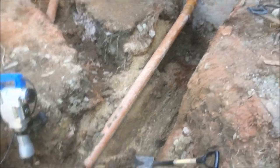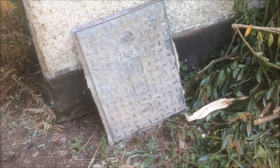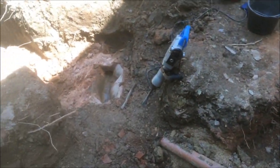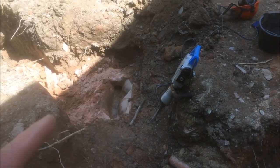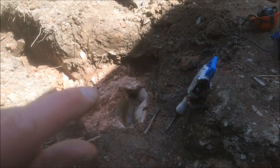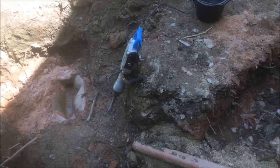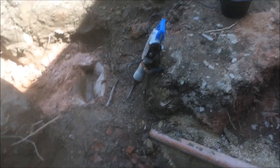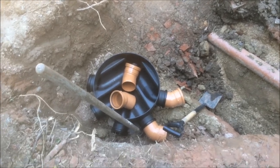It's quite a lot of work, and if you've got one of these old brick-built ones, allow about four hours or more to break out the old manhole, because they have a really thick concrete base on the bottom. There's quite a lot of work to break out even with a fairly meaty breaker. But nowadays we use these plastic ones which should be quicker to install.